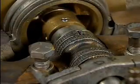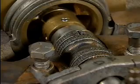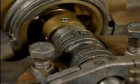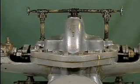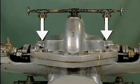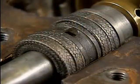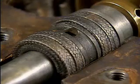In a pump like this one, which pumps water, additional lubrication can be provided by the controlled leakage of water from the area between the shaft and the casing into the packing gland. If more water is needed for lubrication, it can be taken from the discharge end of the pump and fed into the stuffing box through a gland sealing line. In this example, there are two sets of packing rings in the packing gland.